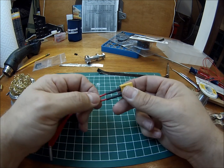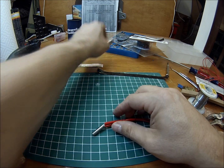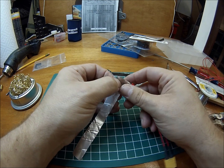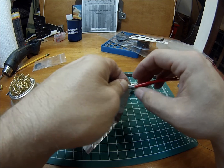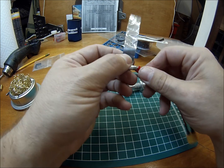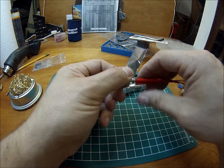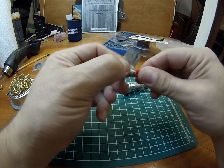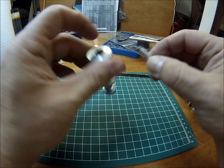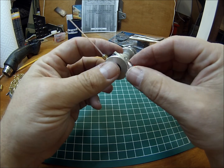What we need to do now is get the aluminum foil wrapped around the heater cartridge so it'll fit. You want to wrap it in the middle of the heater cartridge — do a piece that's about a half inch or a little bit larger. It doesn't need to be much because the contact point is pretty much the center of the heater cartridge. We'll test fit that and do it on the opposite side as well. It looks like I need a little bit more, so I'm going to go cut a little more.